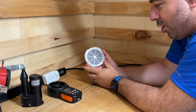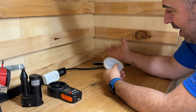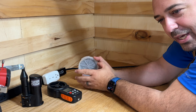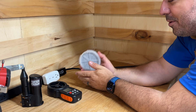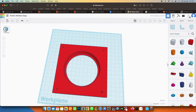I purchased a carbon filter — this is used in some really expensive carbon purification machines, but really all those machines are is a fan sucking air through this filter. Since I already have a fan sucking through here, I'd like to place this filter right here, but my hole is just a tiny bit too big. So I'm going to 3D print my own adapter piece using 3D CAD. It's a simple design: a circle the right diameter of the filter with a raised lip at the bottom, and four small screw holes. That lip holds the filter in place and it's good to go.